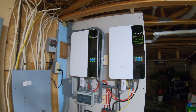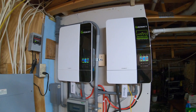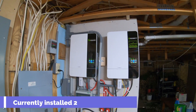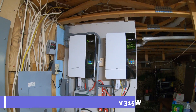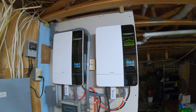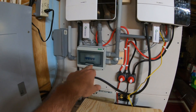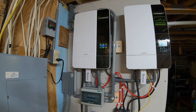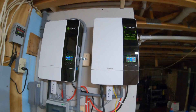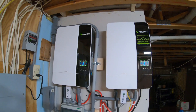Running in from outside I have 24 solar panels feeding in. They are 48-volt, 315-watt panels. They feed into a DC breaker box with on/off switches for PV1 and PV2, and from there they go up into each inverter. This is inverter number one and this is inverter number two. The manual tells you how to configure them.